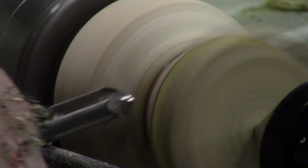I'm just doing a pivoting cut on a fulcrum. I'm not pulling the tool across the tool rest. That's your most stable cut. I'm just pushing it with my hip. The tool is against my body. When I'm getting up to the veneer and the palm, I'm slowing down.